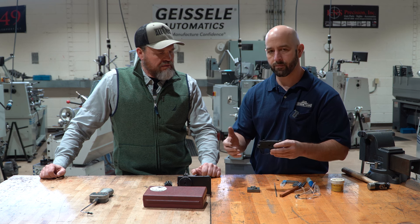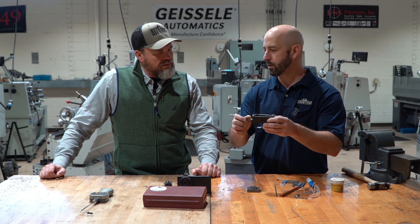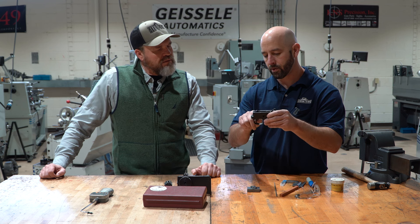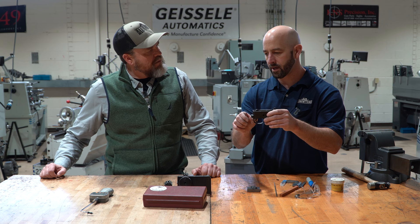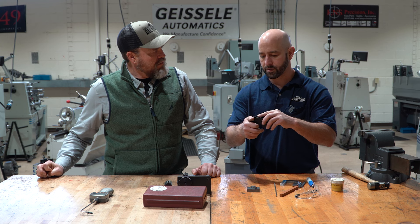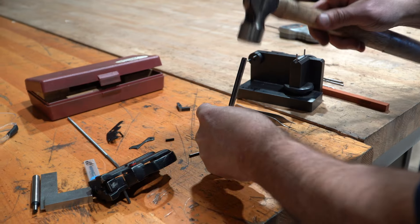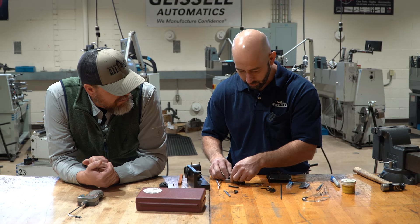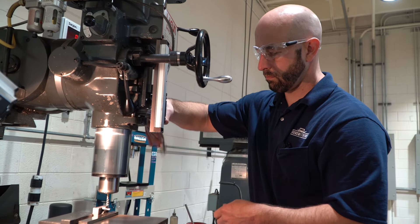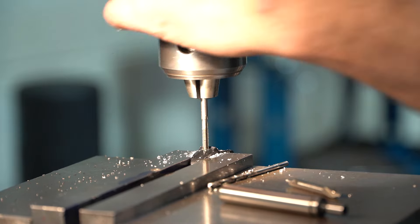I'm back with Mark now, and we've got your trigger group here, Chris. Now that we've got the barrel work and bolt work done, we're going to see what we can do for your trigger. This is your typical factory trigger — it's around six pounds of pressure necessary to release the hammer. We're going to reduce that by about half, ending up with about a three pound trigger. We also want to reduce the amount of creep, which is the mechanical slide of the parts against each other before the hammer is actually released. The third thing we're going to do is put an over-travel screw in your trigger to limit the amount of trigger travel after the hammer is released. After all this is done, you're going to have a much crisper, lighter trigger that's going to be easier to manipulate and allow you to shoot better groups.